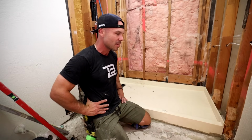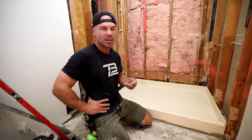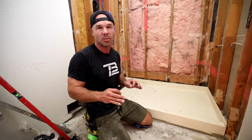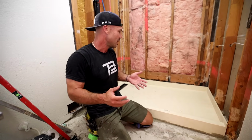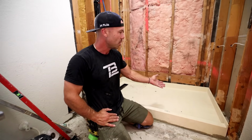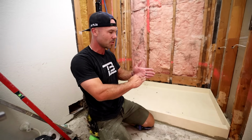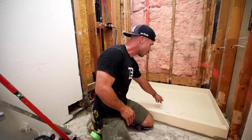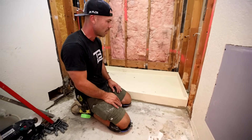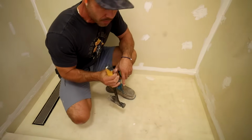And that's the weak point of the puzzle piece showers that we do, like the Schluter, or even using the Flow Effects that I use. If you're not really good with the sheet membrane, you run the risk of leaks in critical points at that floor and wall connection. Or you've got puzzle piece systems like the Wedi or the Hydroblock, where again, you're just relying on a bead of sealant in this really critical floor to wall connection. So any connection is up above the water line, which is really nice. Nothing to worry about on the curb. There's no build out or anything.